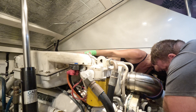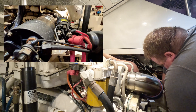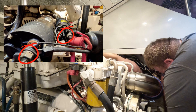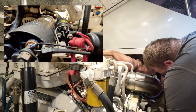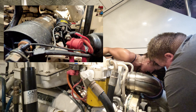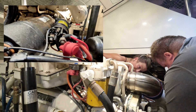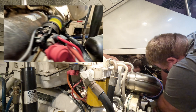We're getting back into it now. I am removing the terminal lug nuts on the end for the positive cable and the negative cable, pulling both of those off. They gave us new bolts from the factory when they did the replacement, so I had to remove those. Caitlin's tightening the final bolts for mounting it to the engine, and she's actually also grabbing wires — putting on that control wire, the positive cable wires, making sure we have them all. There are a couple of wire harnesses we had to grab and make sure we had everything on there correct.